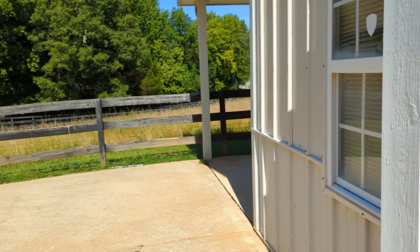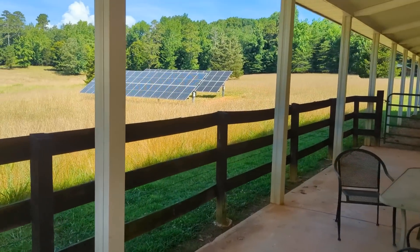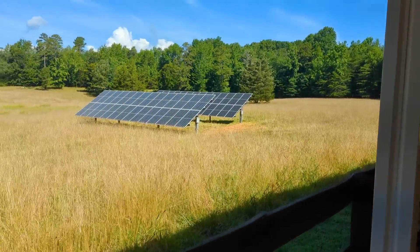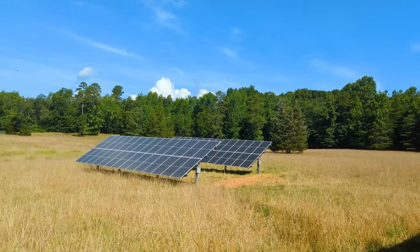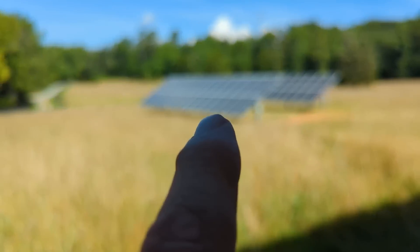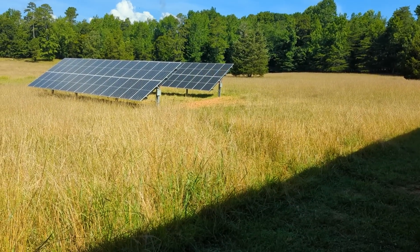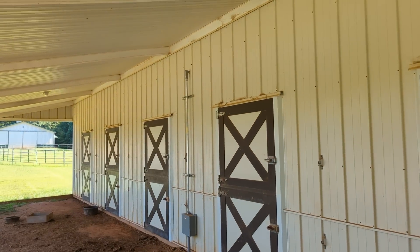The fun part was matching panels when it's almost a year later — I think I did pretty good. The ones in the back might be a little bit darker, but they're the same brand Q-cells. The ones in the back are bifacials — from this angle you can't tell. We're on two Sinclair fixed ground mounts. The first one was put in a year ago, so all I needed to do when adding the new one was bring it over to the existing conduit and pull that wire into the pull box and up and over to the inverters.